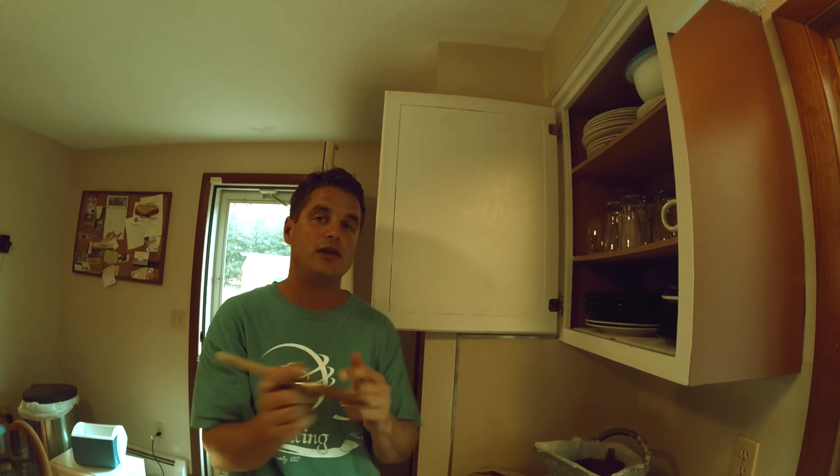So this is gonna get one more coat over here. Now before, I was telling you about the gaps and how you wanna caulk those first. I'm gonna put this down here, and we're gonna come over here now. And I had just painted this here, because as you can see, there's a huge gap here, and a gap here, and there's a gap here and there. So you definitely wanna caulk this.